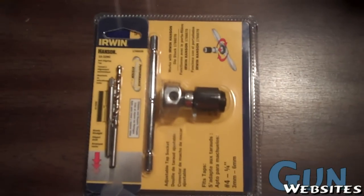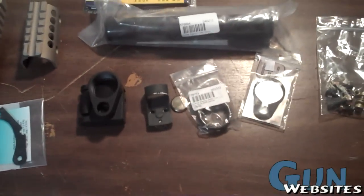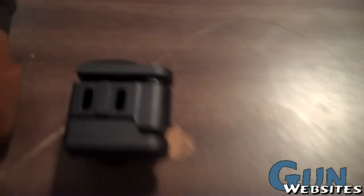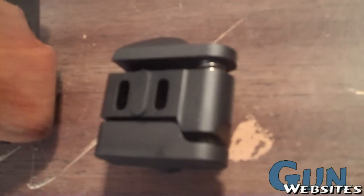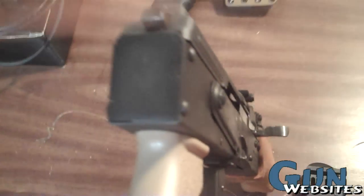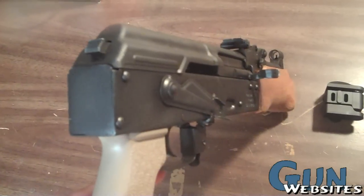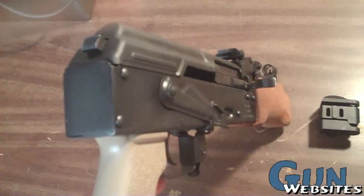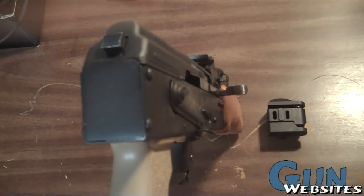I'll need to do this to machine two holes into the back of the receiver trunnion. First thing to do is grind the back of the ACE flat — it has a little notch that's proud, so I'm going to grind that flat. And here's the rear of the receiver for the AK. After that, I'm going to line up the back of the receiver, get it squared up, and mark some lines on there so I can drill holes in the right spot.